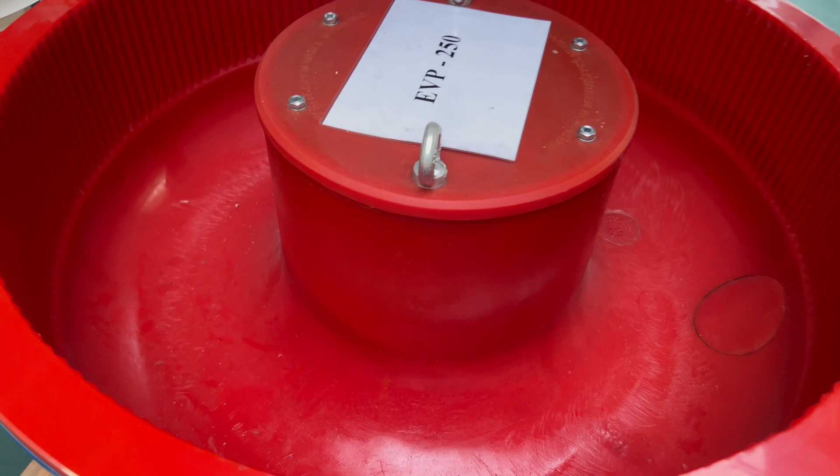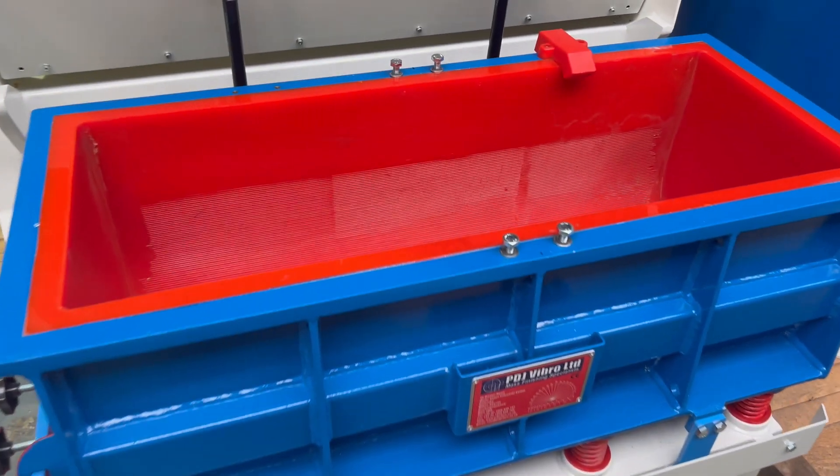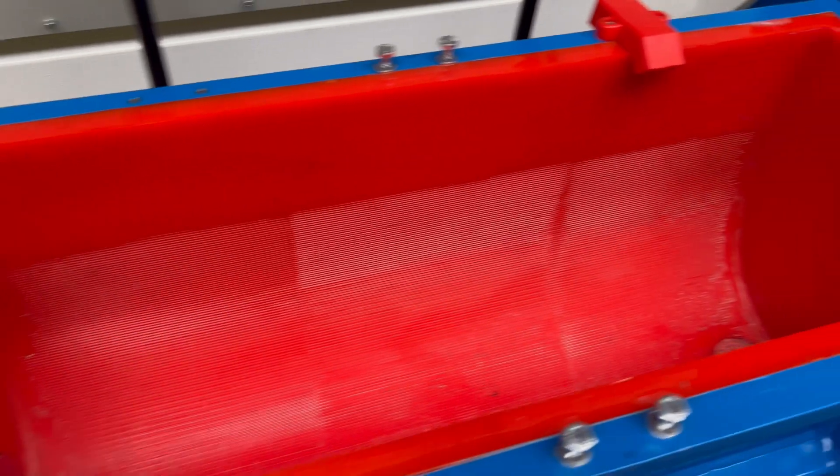However, if you've got very large components and you're concerned about them touching, traditionally we would put them into a rectangular trough where we can put in a divider plate or multiple divider plates to keep the parts away from each other. Without that, the parts will migrate to the ends and chatter.